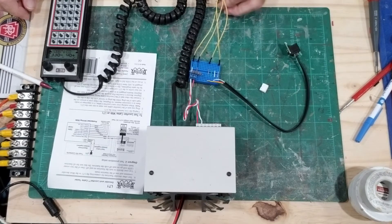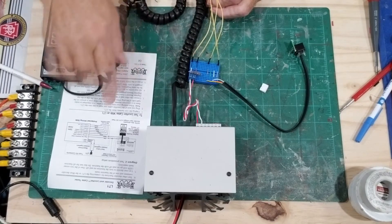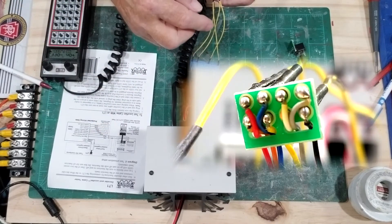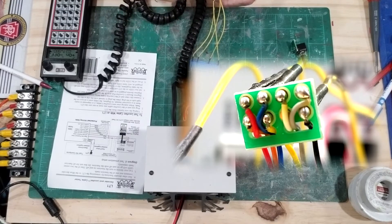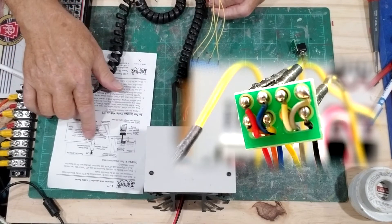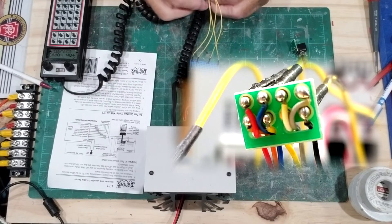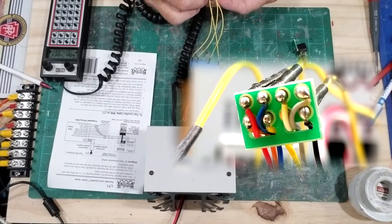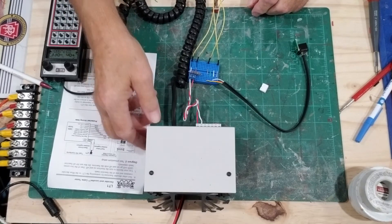What I had to do was make sure Rail A and Rail B were on the correct ones — the black and the red wire. The black is this lead back here and the red one is just the opposite corner. For the gray and orange leads going to the motor, those are the other two wires — this one and just the opposite corner.